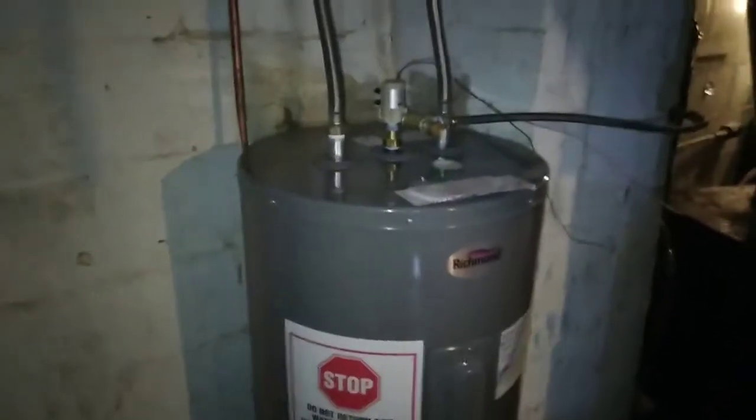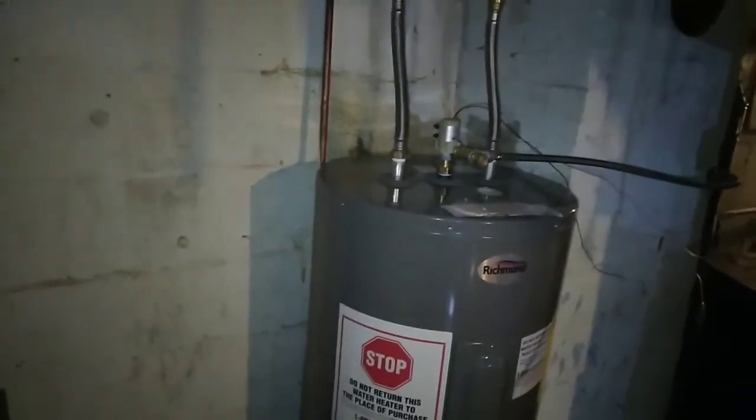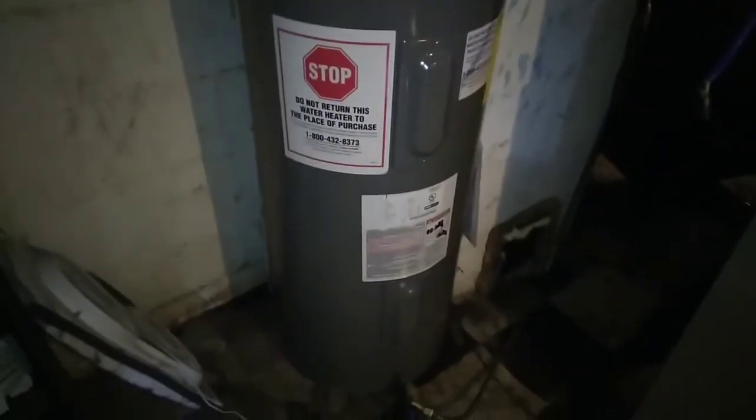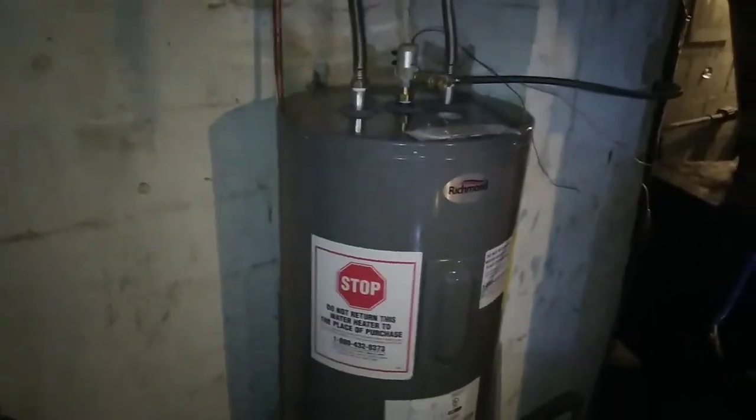It allows it to bleed the air out of the whole system. I've got kitchen, bathroom sinks, and the tub open, so it'll push air out of the whole system. There won't be any jarring of any of the pipes anywhere. And then you shut it down from furthest to nearest, and do your final pressure test. And when that last faucet closes, it will achieve max pressure. And you want to have it fairly quiet for this process. You can hear everything. So anyways, I'm going to keep an eye on this for a couple more minutes until it gets close to being full. I'll go shut down my faucets, and then we'll make sure it's holding pressure, get the fire going.